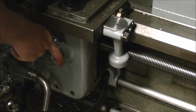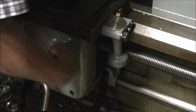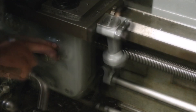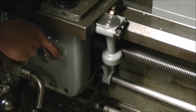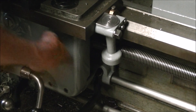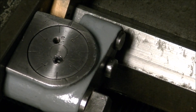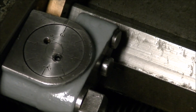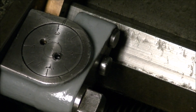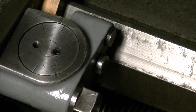When I started testing is when I realized the mistake I'd made. On the original part the dial face and the gear were indexed such that the marks on the dial engaged the mark in the thread dial housing when the half nuts needed to be engaged and disengaged. I didn't take that into account when I pinned the gear to the shaft, so the marks don't quite line up — it's close, but at some point I'll probably have to take the gear off and repin it so it's properly lined up. Although since I don't use the thread dial very much I may not get around to it.